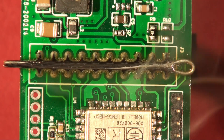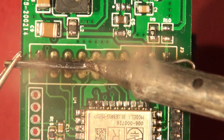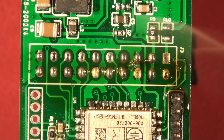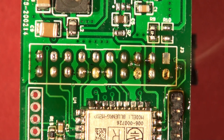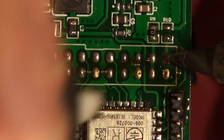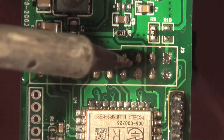And there it goes — the connector has just on its own dropped out the bottom. Then you pull the bus bar off and hopefully most of the solder comes with it. So that's what you're left with. While it's still hot, get the desoldering pump out and give it an outing — it's a bit difficult doing this one-handed.